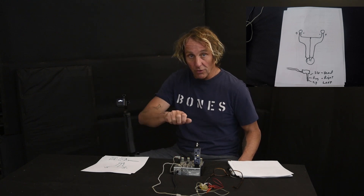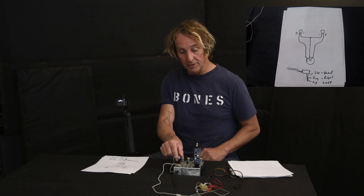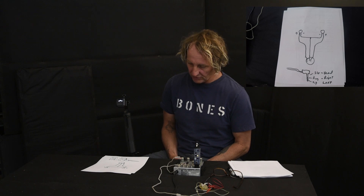We did notice that even with the four-wire system, when panned all the way to one side, we were still getting some leakage. I believe that's in the mixing board, because at some point it's still a three-wire connector — there are op-amps and whatever is driving it. The wiring in the console will vary from console to console. So having a three-wire connector is already a flaw, but the sooner you go to four wires, the more isolation you'll get in panning.